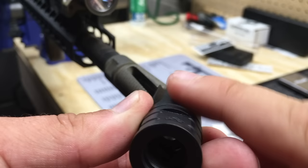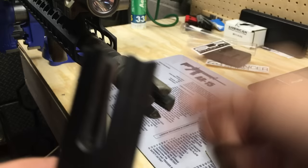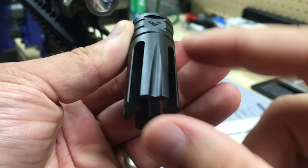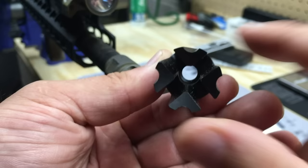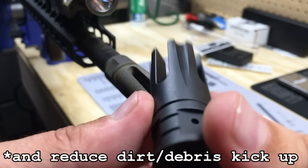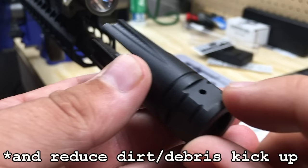The prongs have a slight curve to the side — not quite as much as the Smith Vortex. They do a little machining on the prongs, which I understand is done to reduce the ping you get with these devices. They also index a certain direction, unlike the Smith Vortex and the Bravo Company 249F, which you can just screw right on. This one indexes so the logo is up and the small prong is down, directing more muzzle blast upward for muzzle rise mitigation.